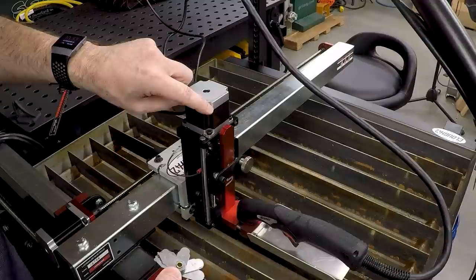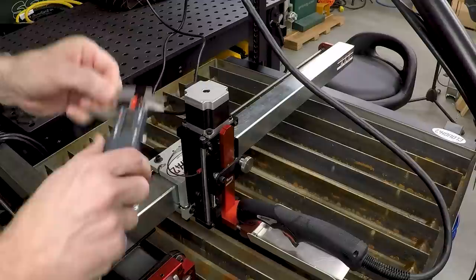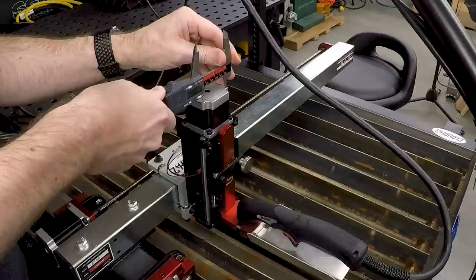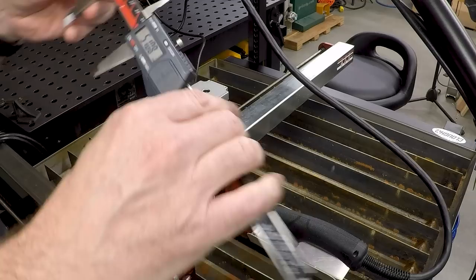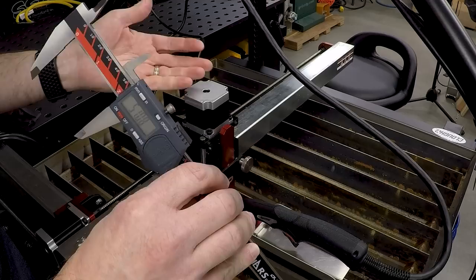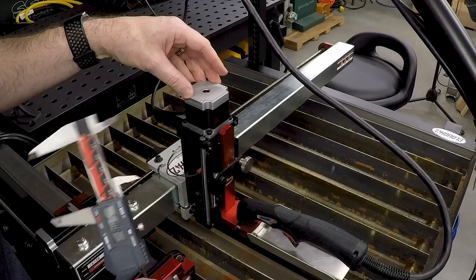The radius of the outside fillets is two and a half millimeters. To determine the spacing of screw holes, take your caliper, measure the inside diameter of one of the screw holes, then zero it out, then use the inside jaws to measure across two of the screw holes. That gives you a direct reading — in this case 51.08 millimeters. Everything on this motor is metric; these are M3 screws. So this is a nominal 51 millimeters across between those two. I'll measure the rest of the dimensions and then we'll go into the computer to walk through the design.